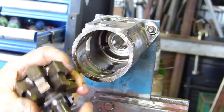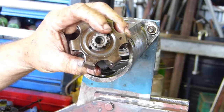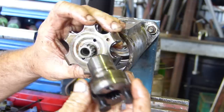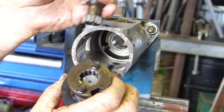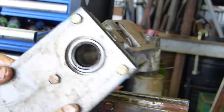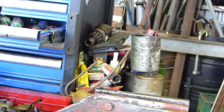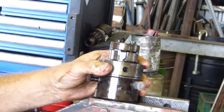This governor plate, when it sits down through the hole, the flats on it go into a recess down there. Some people don't get it lined up and if it's around the wrong way you can't get it in properly. Look for the flats before you put this in. There's a master spline on the shaft and a master spline on the head - you can't get that wrong, it just won't go on. That's given us the bare housing now. There's nothing left in there but to take the seal out and give it a good bath - we're right down to the bare shell.